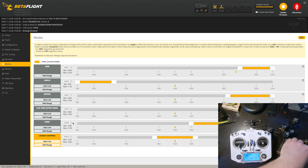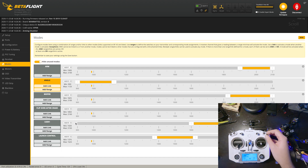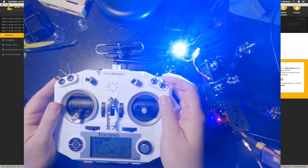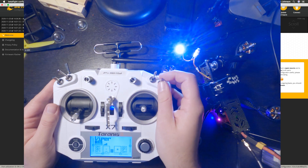I'm going to turn my drone on — and we have signal, it's linked to the controller. So now on user 1 I'm going to set this to auto and we're going to just flip this switch. This switch is aux 5. So now it's set up. Once I plug my LED into here, we should be able to turn it on and off with our controller. I'm going to plug the drone in — looks like the light has power. When I switch this down, it turns off. Perfect.